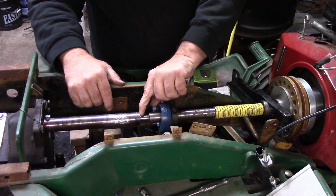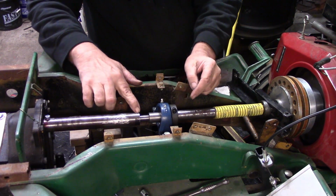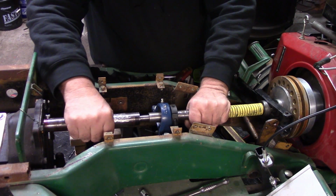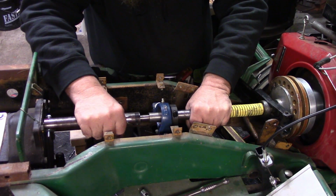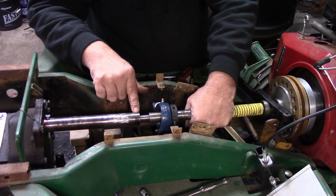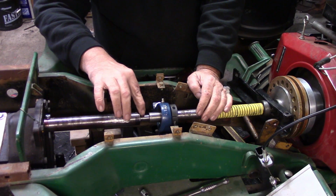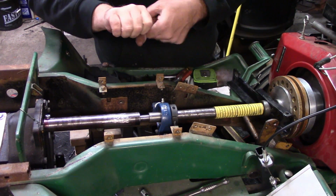the original hole in the shaft is about 2/3 inside there. So I think what we're going to have to end up doing, I'm going to turn this thing probably 90 degrees, drill my hole through, and we'll probably end up welding that other hole in the shaft. Weld that hole shut, because that's going to be a twist spot.